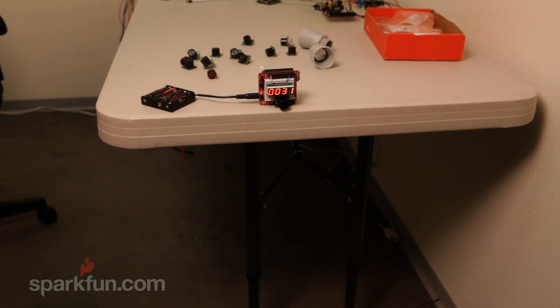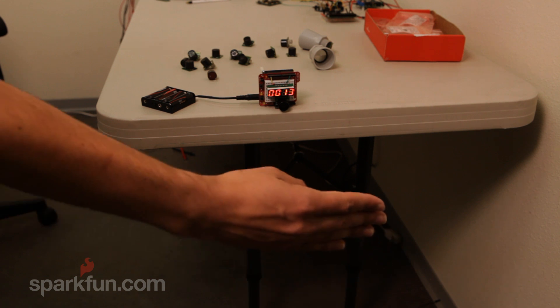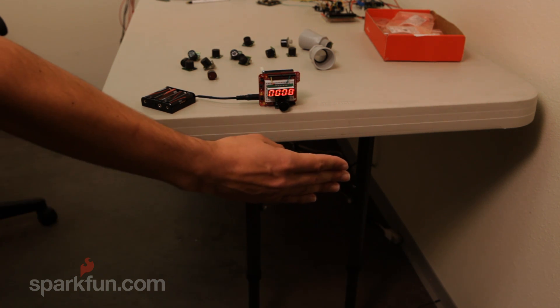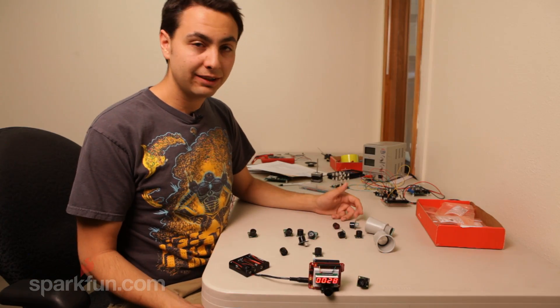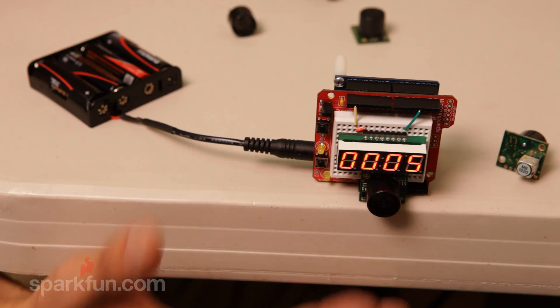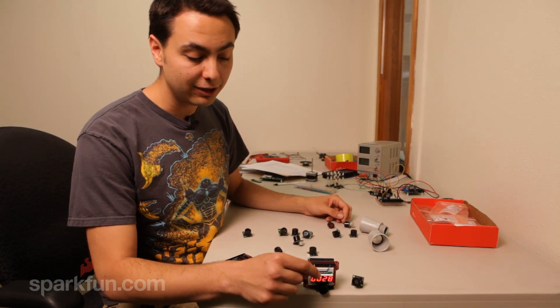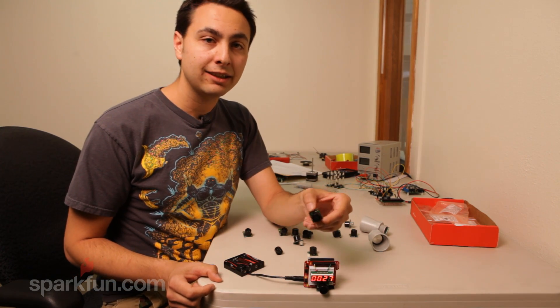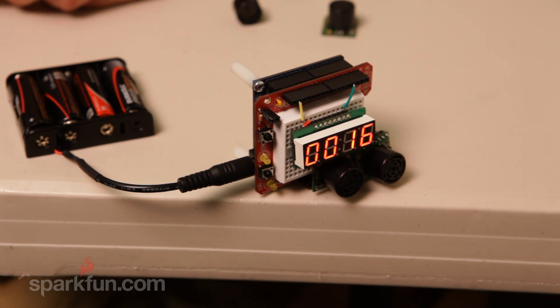This is displaying the distance in inches. As I put my hand in front of it, you can see the distance go down and back up. All these sensors have a minimum sensing distance of about six or seven inches. They max out at about 21 feet for the LV series and about 25 feet for the XL series. We've got two hooked up here, and as you can see, things are getting a little weird — they're likely to interfere with each other as their timing will get off. So you'll need to control them individually using the RX pin.